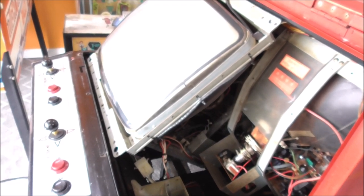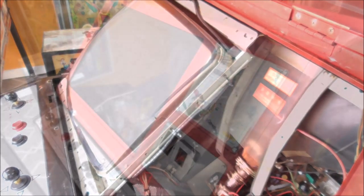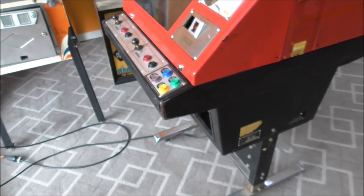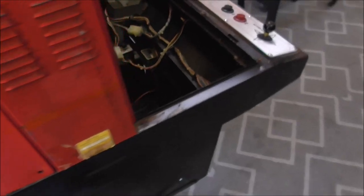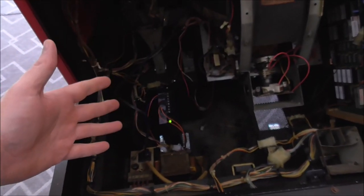We've got sound but no image yet. I had the wrong video line hooked up, so I swapped them. Let's turn it on one more time. It's kind of hard to see because it's so bright out right now — we've got it right here in the front window. But we've got it back up. Joe, what was the problem with the deflection collapsing? Bad solder. He did the cap kit, put the new flyback back in, and now it's deflecting properly. Looking pretty good.